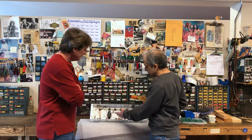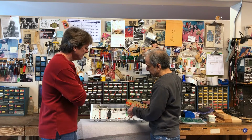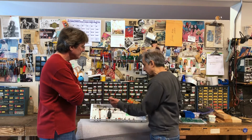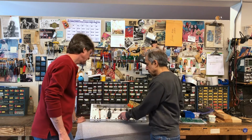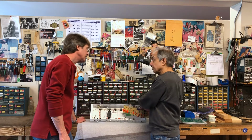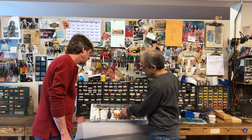And what we're going to be able to do is take a signal off of the switching system that normally would be separating between the two master volumes. Instead of going straight into the power amp, that signal is now going to go into a tube buffer driver. This tube buffer driver is going to go out through the effects send. You're going to bring the signal back in, like I just talked about, into the return. The return is going to take you right back into the power amp section, and away you go.